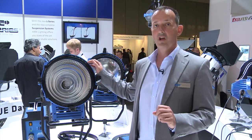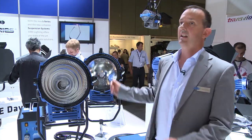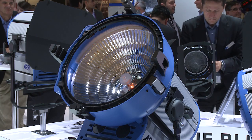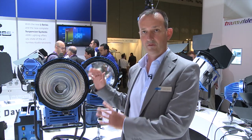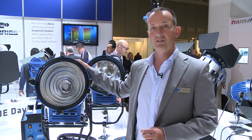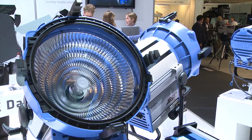With a max reflector in spot, compared to the old ARRI Sun with the lens, we get more light out of these max reflector fixtures because we can take away the lenses and we don't have the losses from transmission through glass anymore. This gives us, as I said before, plus 30% in spot and plus 10% in flat.